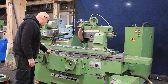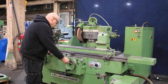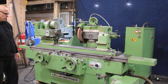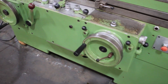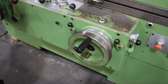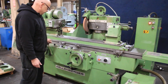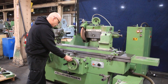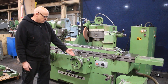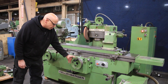I'm going to go ahead and show you a plunge grind. With a plunge grind we don't want the table, so I'll shut that off. You see we feed in continuously until we get down to zero. This is taking quite a bit off and I'm going quite fast. Now you've reached zero — once you're done sparking out and you back up, put it back into neutral and re-engage, and you'll have a much shorter grind. We only want to set that for a few thousandths past your actual stock removal. This adjusts your dial — when you loosen this you can adjust your dial.